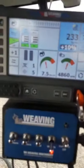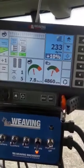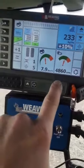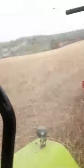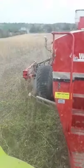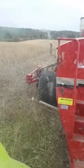As I'm driving across the field you can see my variable rate box — I've got the seed and in this case the slug pellets mixed with the BioLite product. I've got a forward speed of just under eight kilometers an hour and a fan speed of 4800 RPM. The fan blows the seed through those tubes you can see just behind that wheel, and it drops down into those coulters and into the ground.